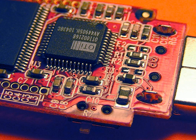Chip-on-flex (COF), a variation of COB, where a chip is mounted directly to a flex circuit. Chip-on-glass (COG), a variation of COB, where a chip, typically a liquid crystal display (LCD) controller, is mounted directly on glass. There are often subtle variations in package details from manufacturer to manufacturer, and even though standard designations are used, designers need to confirm dimensions when laying out printed circuit boards.